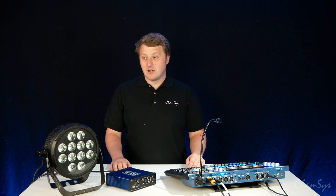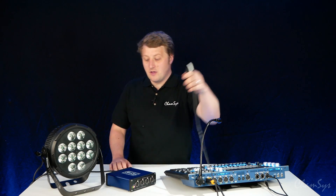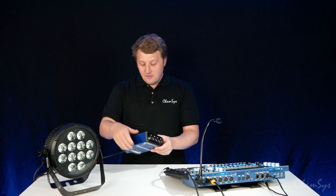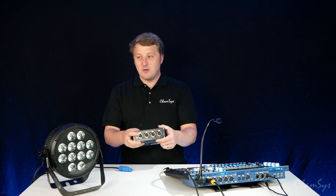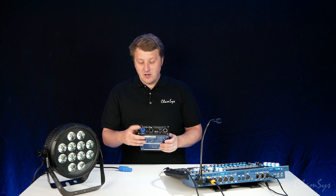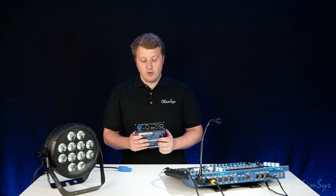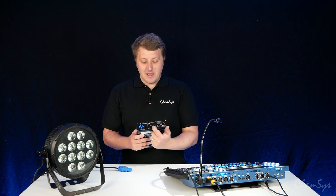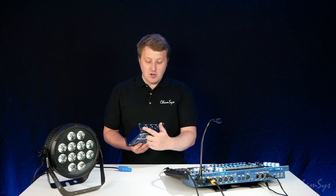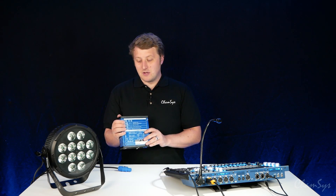Let's clear that and switch it off. I'm now going to take my DMX cable out of the back of my console and connect it to one of the DMX outputs on my Snakesys B4. The B4 has four DMX output ports on the front, which can also be set to input. On the back you've got a PowerCon line input, a network port, and a dedicated DMX input port. You also have address dials on the back to set the ArtNet universe the box is decoding, and mode switches on the front — underneath the box shows what the various mode switches mean.